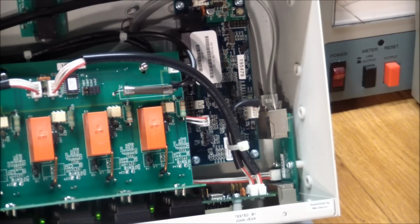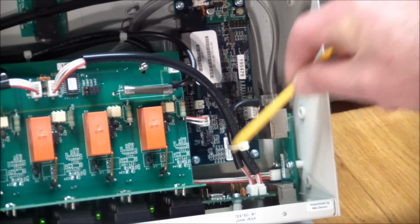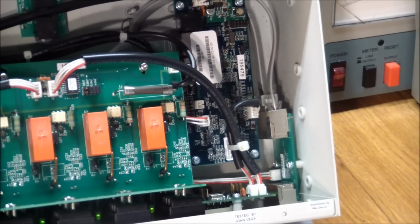But after playing around with that thing for a while, I had another look at the manual, and it's not really a decoy, but read the damn manual, and you'll find that the real reset button, the one that they are referring to, is mounted underneath the board at this location. So what you've got to do is, there's a hole next to the power to the ammeter, and you have to stick a paper clip through that and hold the button in for 15 seconds, and after 15 seconds everything gets reset to factory defaults.